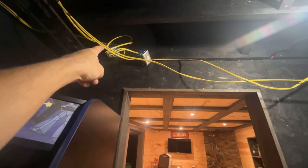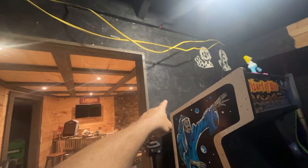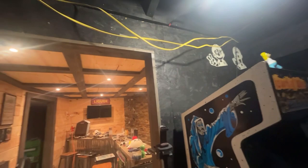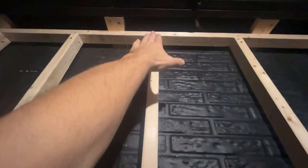I'm not worried about that at all. If I was putting it behind the wall and then putting pine over top of it, that's not acceptable — if you ever have a wire come loose or need to get into that box, you wouldn't be able to because it would be buried in the wall. But since these ceilings are going to be a drop ceiling, I can always drop the panel down and access that wire. So what I'm going to do first is make a 2x4 grid one row all the way around the perimeter. When I put this 2x4 up here for the grid around the perimeter, I'm going to keep it away from this three quarters of an inch so that when I put the pine up and then put my rough sawn piece on, it stays the same width.